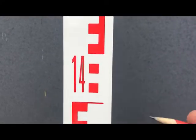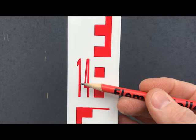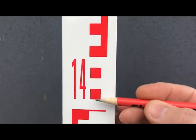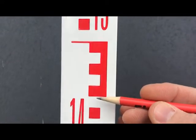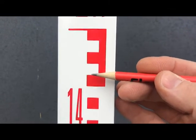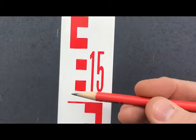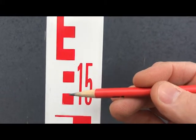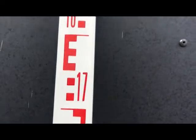Here's a look at the metric side. The metric side is similar in that the space has value. This really isn't 14 — it's 1.4 meters. So 1.4 meters is right here on this line. So this is 1.41, 1.42, 1.43, 1.44, 1.45. You can see we're still on this right-hand side with this sort of backwards-looking E. So 1.45, 1.46, 1.47, 1.48, 1.49, 1.5. Then the 1.5 meters switches to the left side of the rod and we go up the same scale there: 1.51, 1.52, 1.53, 1.54, 1.55, and so on.